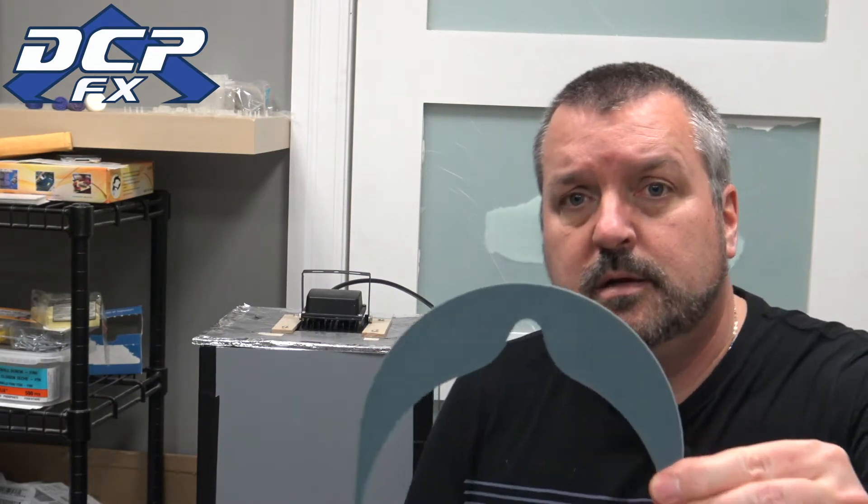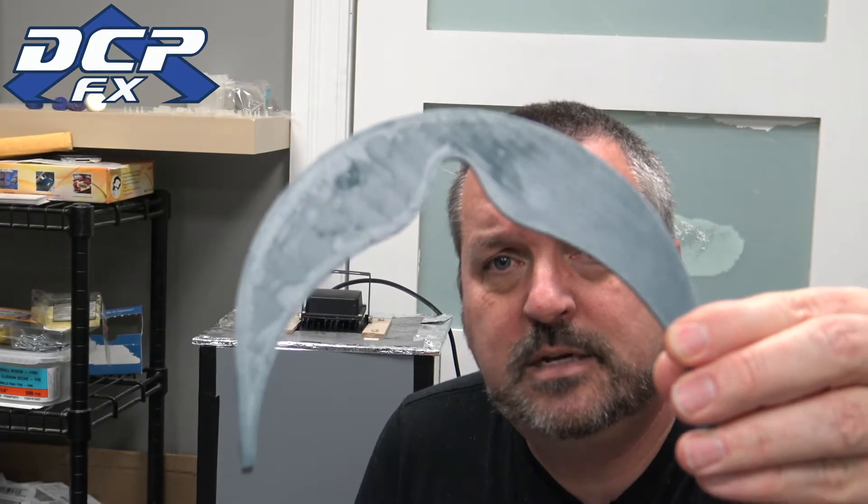What I did is I reprinted the clear bits for the LEDs on the pad. I put on my thinking cap, got my calipers, measured exactly what they were, made them that size in the slicing program, and printed them flat to the bed. If you don't know how to resin print — the first couple layers print really long and become thick, they get what they call elephant foot. For me that's perfect because they slide in, and because the elephant foot was on the bed side, when I knocked them off I still have that little lip so it goes in just to the lip. Perfect.